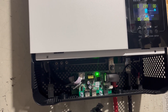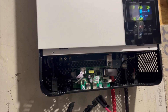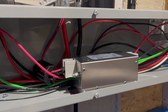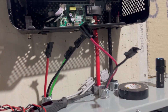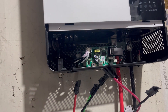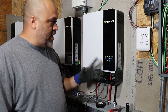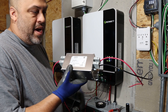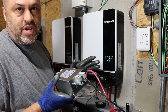Right now the inverter looks like all the others. I'm going to try to hook everything back up and figure out what's going on with the PV — whether it's backwards or related to my filter. The inverter is not making the sound with the PV wires disconnected, even with the switch off. I'll try hooking up a straight cable from the PV to test it after I confirm everything else is working without the filter connected.